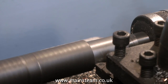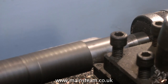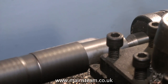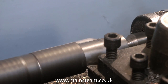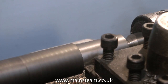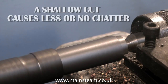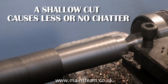Much patience is required when using a lathe. If you rush it, you will spoil the work — you may even break off the tool tip and have to replace it, and you will end up with a very bad surface finish. The surface finish in this case is not important, because it's going to be used to plug a hole in an engine base plate. The point I'm trying to get across is: take your time when using a lathe, because if you break the tool, it will only take longer because you have to change it.